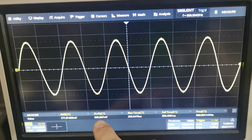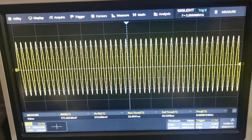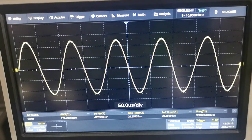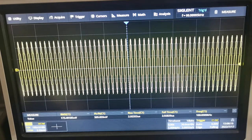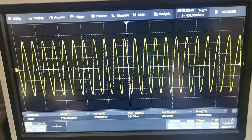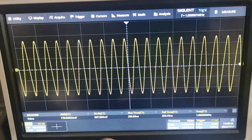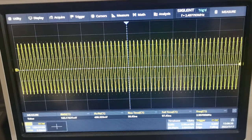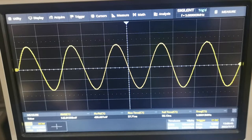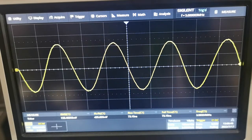So 500 is the value at 1 kHz. Let's crank it up — 10 kHz, of course the same. 100 kHz, of course the same. Let's crank it up to 1 megahertz — still the same. Remember the specification for this attenuator was 2 megahertz. At 2 megahertz — whoa, it goes down. And at 5 megahertz — isn't that just amazing.